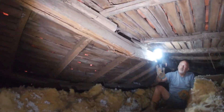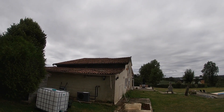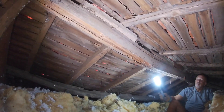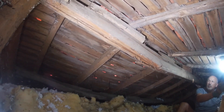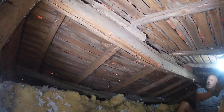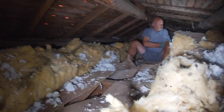While we're here, we'll show you a picture from the outside of the house — you can see that the roof is bowing in in the middle. The main ridge beam has got a crack all the way through it. So we're going to formulate a plan and put a temporary support in just to make sure it doesn't get any worse, and then we can look at lifting it up and fixing it permanently. We'll get it temporarily supported as soon as you go to the shop this week. Right, we'll have to find another way around this.